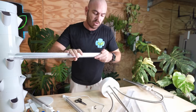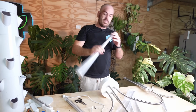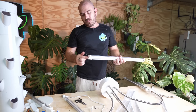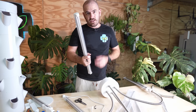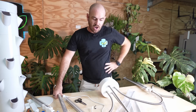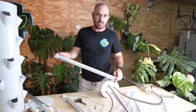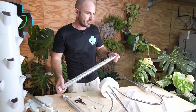If you stumble across them, I would avoid them. These are Monios T8 LED grow lights, and they are electrically unsafe because at the end there is an exposed pin. If anyone puts their finger into those pin holes, they're going to get a full 240-volt shock. I probably shouldn't be using them but these are the ones I have available right now — I'm going to tape up the ends. These came from Amazon, really cheap, but they're not Australian standard, which is concerning that you can get them through Amazon.